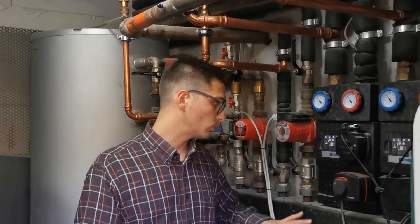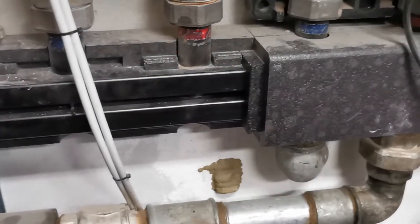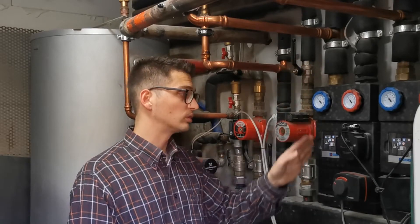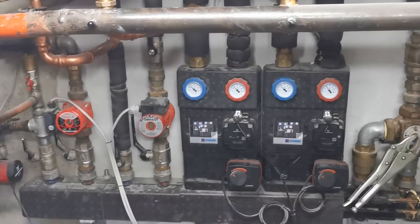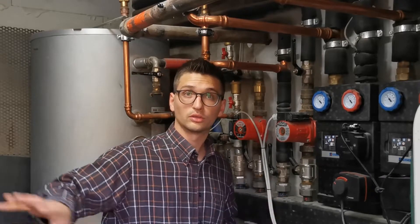Now let's move to the house heating system, the pumps, and the other piping. First of all, the water collector is the most important point here — it collects the hot water coming from the boiler and returning to the boiler, as well as all the hot water going toward the heating circuits and the cold water coming back from them. The hot water from the boiler is distributed to all the hot lines, and all the cold lines converge into one pipe that is the return point for cold water into the boiler.